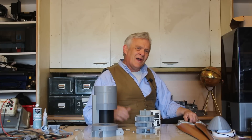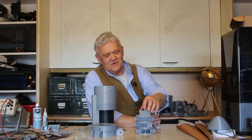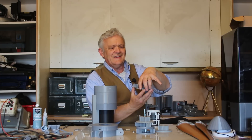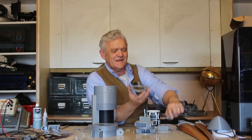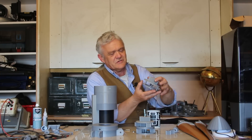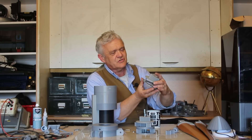Now the bad news. While I was going to do some testing and showing, it suddenly went really, really quiet and spun like crazy. Took it apart and discovered this — one of the planet gears has sheared. If I take the planets off you'll see the ring carrier — it's sheared off right there against the sun. This is the top gear which took all the stresses and all the torque.